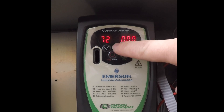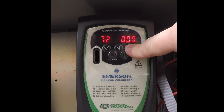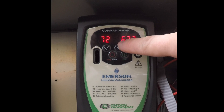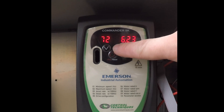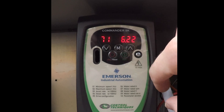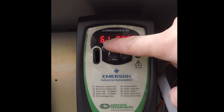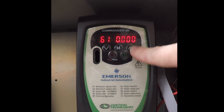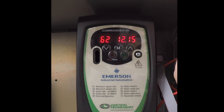Go up to parameter 72 and hit menu — you hit the menu key to set the parameter. I'm going to set this one to 623. Parameter 623 is hours dot minutes. Now when your parameter number is blinking, scroll back down to 61. You can see my machine has zero years, zero days. Go up to 62: 12 hours and 15 minutes.